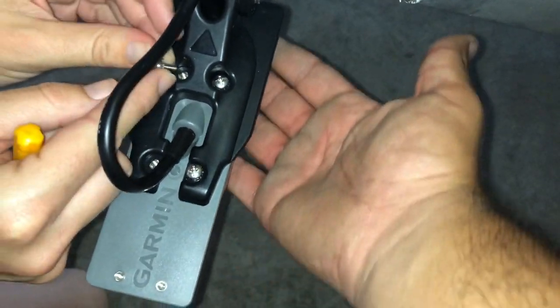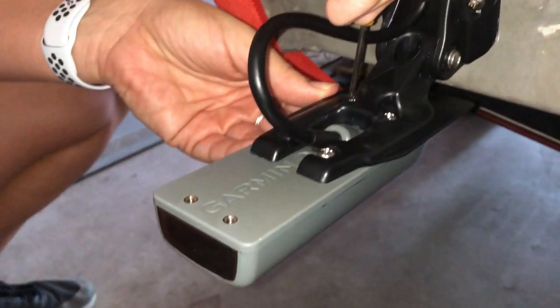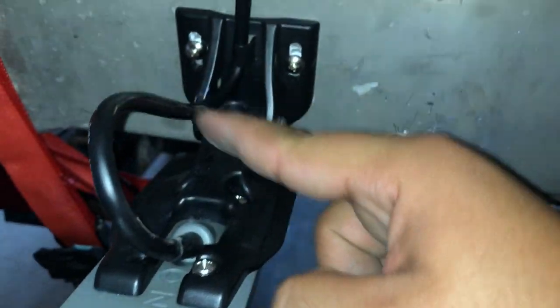So what we did here: we put the transducer on the transducer mount. The washer goes first, then the small screws, and then you line it up and make sure it all fits. We recommend a smaller screwdriver so you can get your hand in there. We're going to do about six of those and then we'll be done. Make sure you put your cable through with a small loop and run it up.